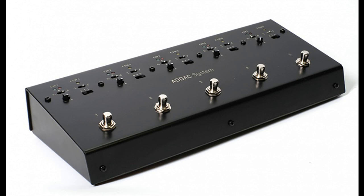External expression pedal controls allow toe-to-heel, mute, or heel-to-toe functions, as well as an attenuverter enabling a positive 0 to +5V max range or negative 0 to -5V max range. An output state LED monitor is also included so users can see the output voltage state of the foot switch.